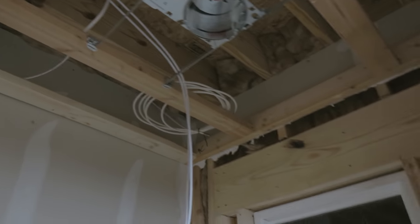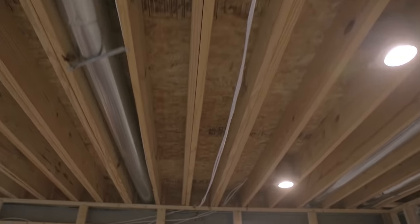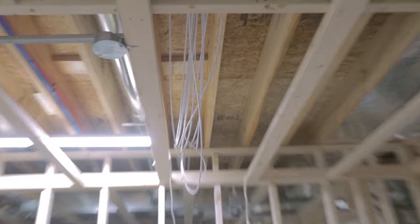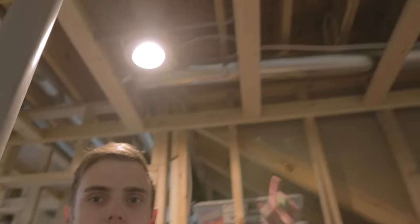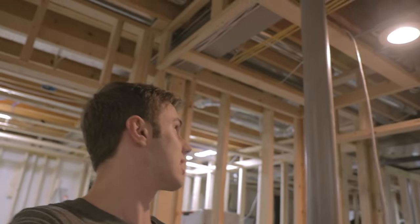We just finished up the last two lines — one for an access point outside and one for a security camera. We have to tack them up still, but they're running above the power lines. We're going to tack all of these cables up. I zip-tied this off here and all of these cables are going to be hung up in this rafter channel with J-hooks. Those are still in shipping. That moment when you think the job's done, but you forget you have one extra line to run — we still have to run the line for an access point.